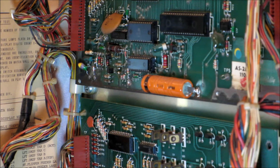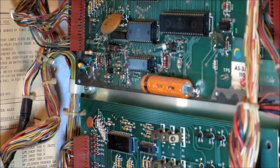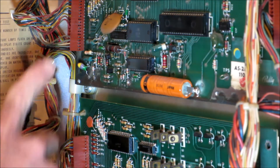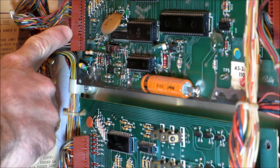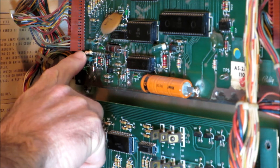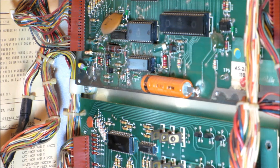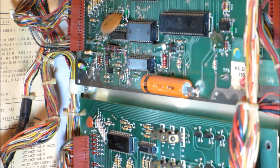While working on the machine, I noticed the MPU LED — when you turn on the machine it blinks briefly, then blinks seven times, with that seventh blink testing 43 volts on the MPU. It stopped working; I was only getting six blinks randomly without touching anything electronic. I traced 43 volts through the schematic and could see it on one side of resistor R13 but not the other. Turns out that resistor had just gone bad — didn't look cooked or anything. Replaced it and got 43 volts back into the circuit.